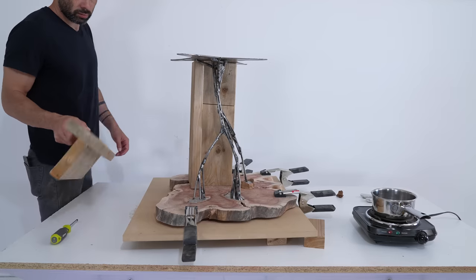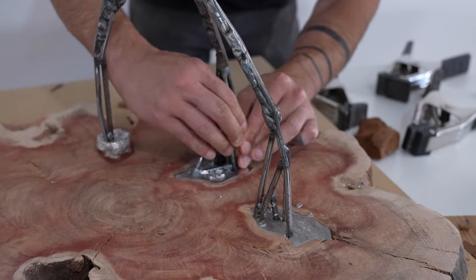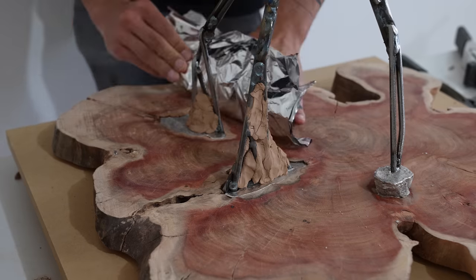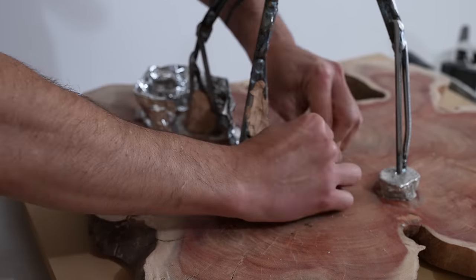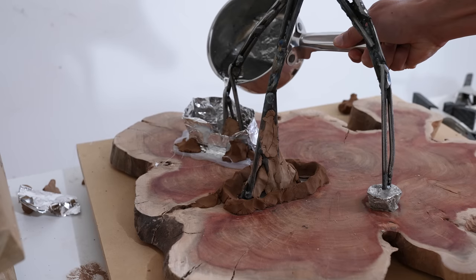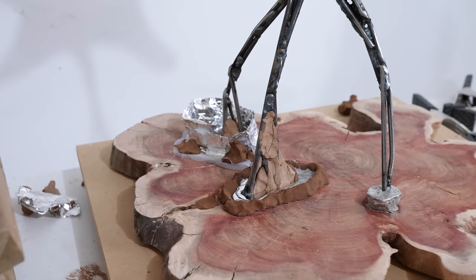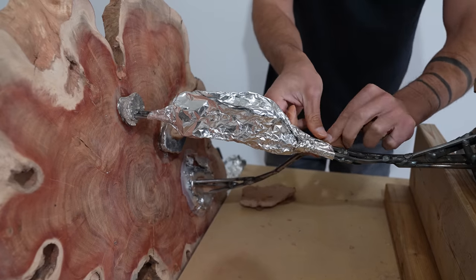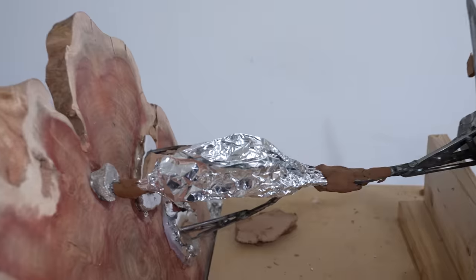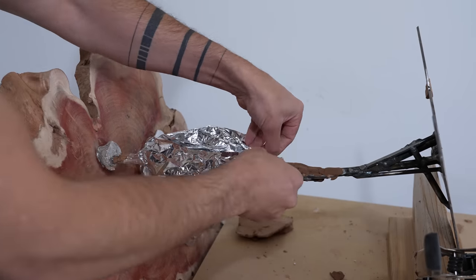For coating the top part of the legs I flipped the table upside down and used some additional clay that I let completely dry as filler in between the steel. I also started experimenting with tin foil to see if that would work well for mold making and tested that against the clay. The next pours went well, but it became clear that tin foil was the quick and easy way to create forms to cover up the steel. The tin foil gave the tin a faceted and angular surface, which could be quite cool, but not really what I'm going for on this project.